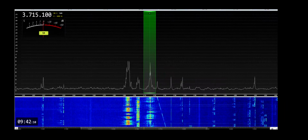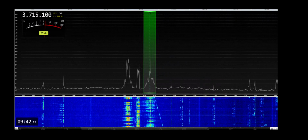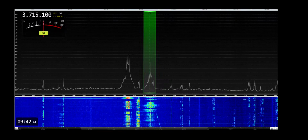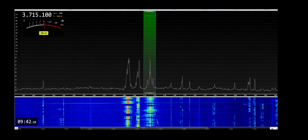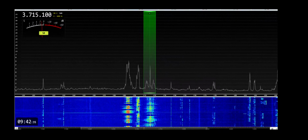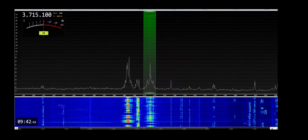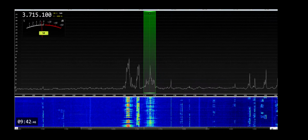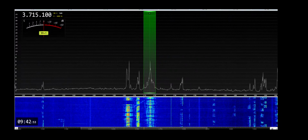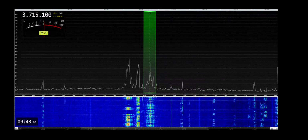And I did have a little problem with my PMR7 the last few weeks. It seemed like the squelch was coming in when it shouldn't have. I had it turned all the way off, don't use it on AM. And that circuit is very compact and hard to get around in. What I ended up doing was I just went in there and lifted the wiper off the squelch pot, and that disabled the squelch stage so it no longer operates. Turning it down all the way didn't really always get it out. Sometimes it did, sometimes it didn't, and it seemed like the longer the receiver was on, the more likely it was that the squelch would try to kick in a little bit. Couldn't get any background noise on some antennas. On other antennas I could. Anyway, that'll do for my old buzzard transmission this time.